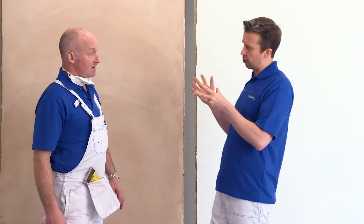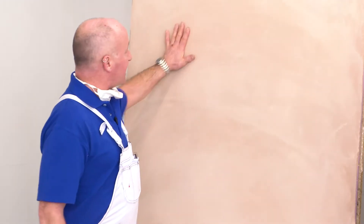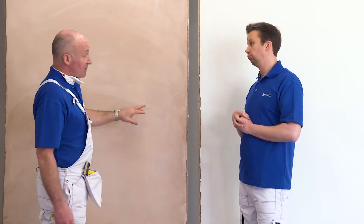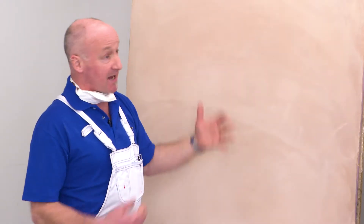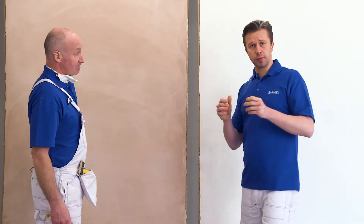Great, so basics — you need to make sure the plaster is completely dry before you do anything. How can we tell the plaster is completely dry, Chris? This light uniform background like this is when it's completely dry; any darker areas means that it's still wet. And sometimes, depending on how many coats and the depth of the plaster, it can take weeks to dry through. As tempted as you might be to speed this process up with heaters or dehumidifiers, don't — you'll probably crack the plaster.